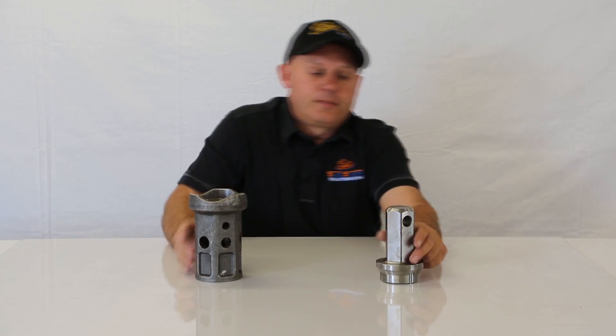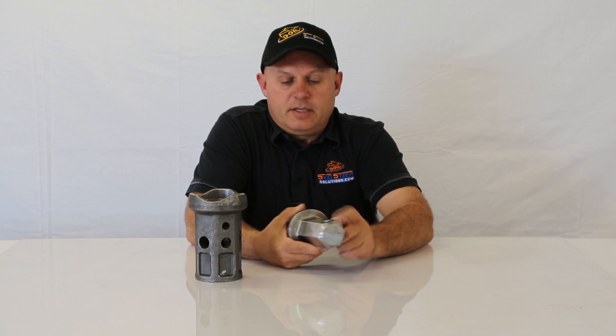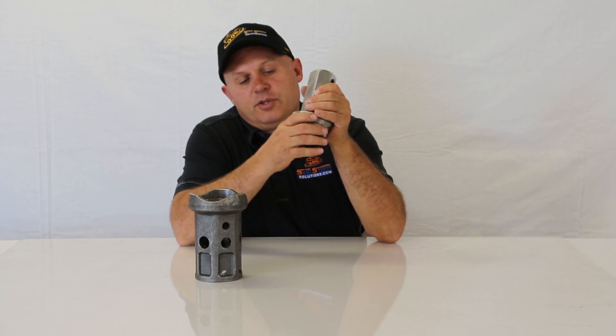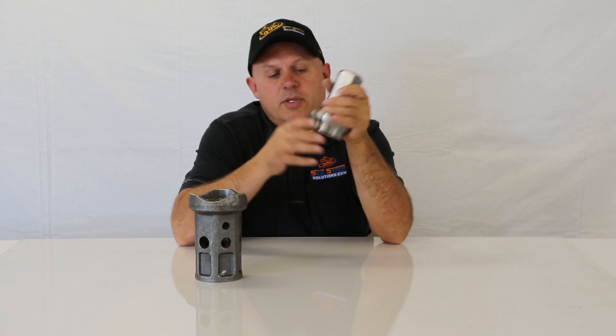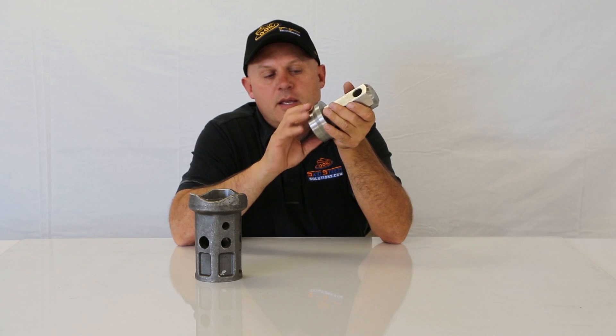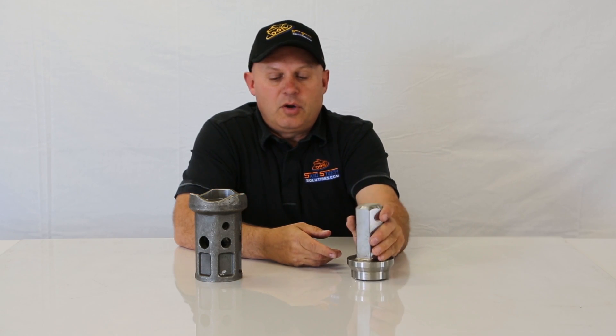So that's the hub. This is a two inch hex output shaft. It has a single hole. This matches pretty much everything that's in the market today. Your heavy wall tubing is going to fit over top of this. We have a taper on this so that if your tubing is not exactly perfect, it will still center itself properly. You put your weld in here and you're pretty much good to go.